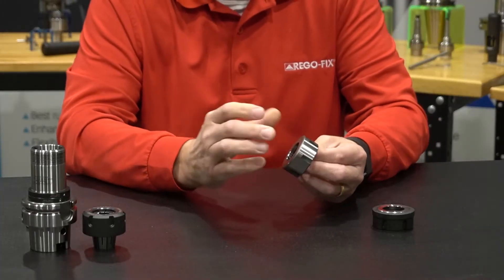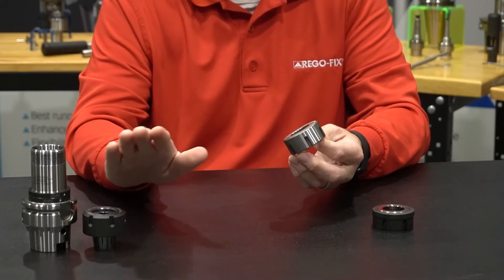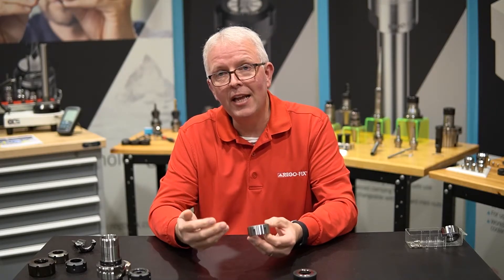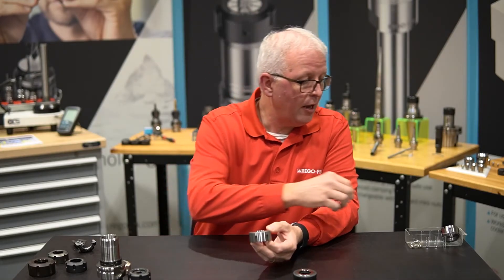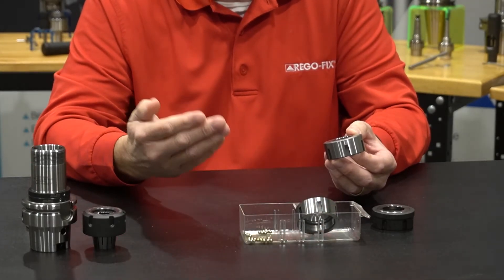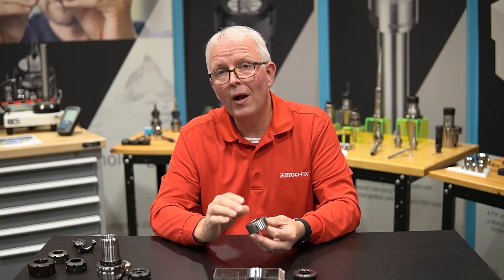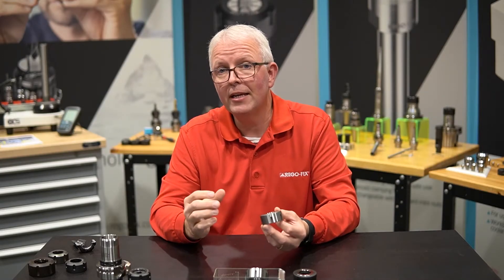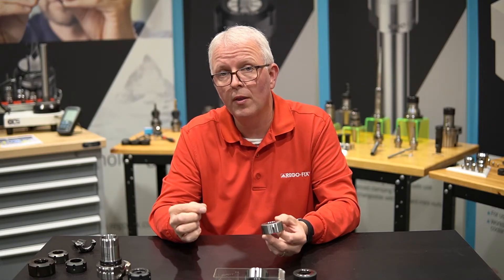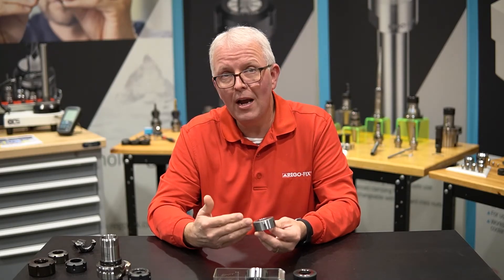Another very popular type of nut in the market is the ball bearing nut, and this is the primary competition we see to the friction bearing. It does work very well. The only problem is it has standard round ball bearings inside. I went ahead and took one apart — I have all the different parts here in front of us, and these are standard round bearings. As I tighten my assembly together, those round bearings are getting squished. Every time they get squished, they basically get deformed, and I create little micro flat spots on each one of the ball bearings. So over time and use, I have to rebuild the nut or I have to replace it.